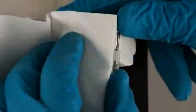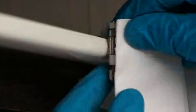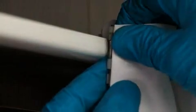Attach the swivel plates to the ends of the track. The plates are right and left specific and are marked with an R or L. The rivets attached to the swivel plates snap into the control end and/or the swivel arm between the upper and lower clips of the swivel plate.